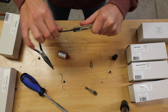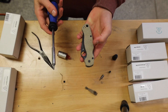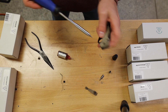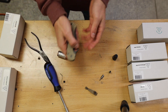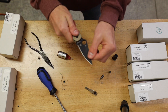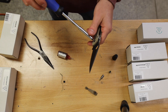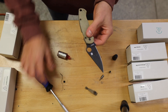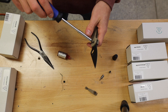You don't want it to wobble when it's out, but you don't want it to be too stiff. Grab your T10, get into the pivot and gently snug both sides down. Try to get them as even as possible and then see how it flips. Check the blade play — there's quite a bit there, so go ahead and tighten them down just a little bit more on each side and check again.